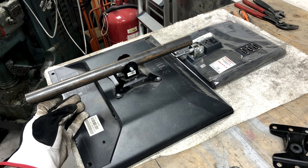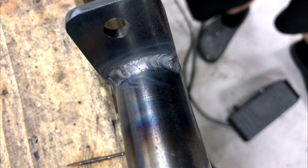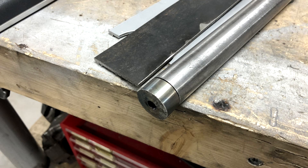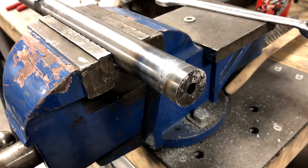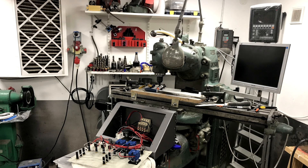He started with a tube, notched a hole for the big screen's bolt and welded in a reinforcement tube. For the much lighter top screen he just added some plate to the top of the main tube with a hole for its bolt. To attach the whole thing he made a captive nut of sorts and attached it to the bottom of the main tube. This let him attach it back to the monitor arm from the mill — not the most solid thing, but it does the job. Standing behind the shields it's a bit far away, but otherwise it worked well.